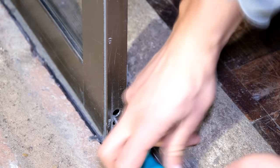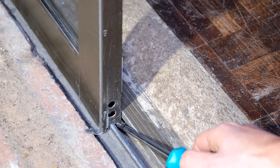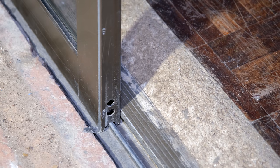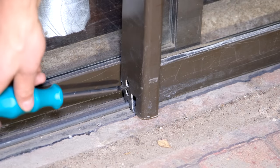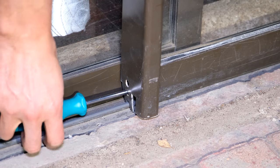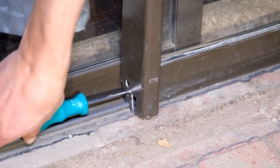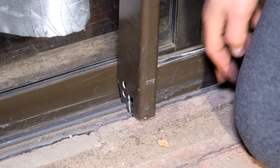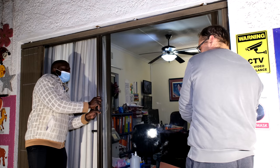You can see the sliding door is now resting on the track and the wheel is at the minimum position. I must do the same on the back wheel, making sure that wheel is also in the uppermost position. I'm using a star screwdriver. Now the sliding door is resting on the track and it'll be easier to remove it.